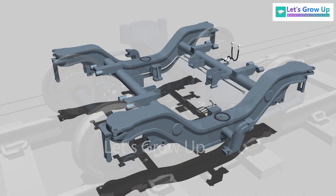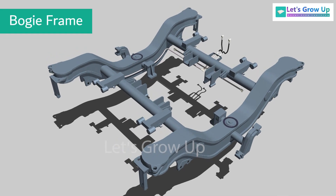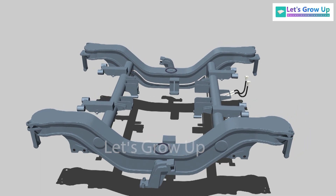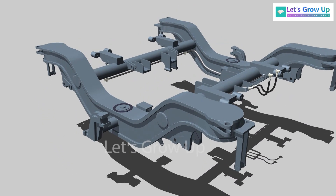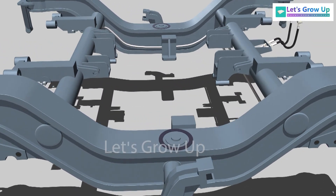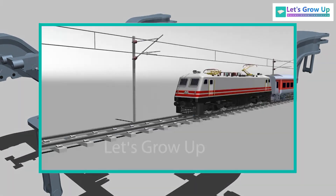The bogie frame is an important part of this bogie. It consists of two side Y-shaped members. This longitudinal beam is connected by two tubular steel members. The minimum strength of this structure is 52 kilograms per square millimeter with D-class weld. The bogie frame is a solid welded frame made of steel sheets and forged or cast parts.